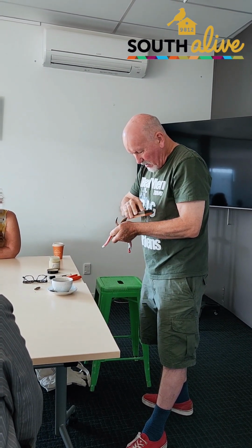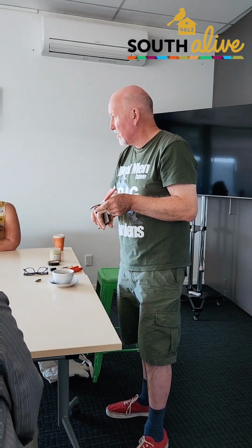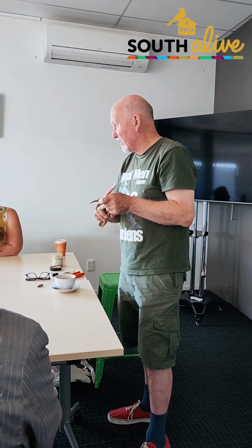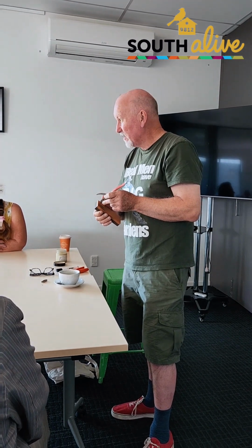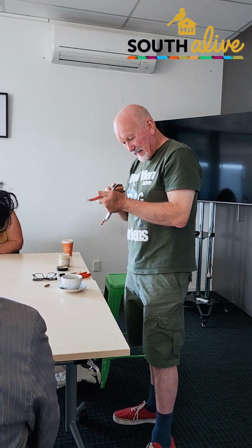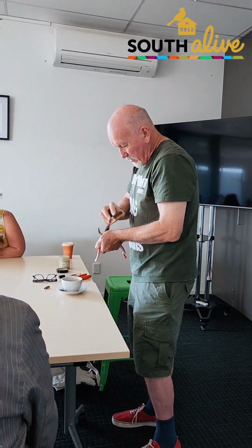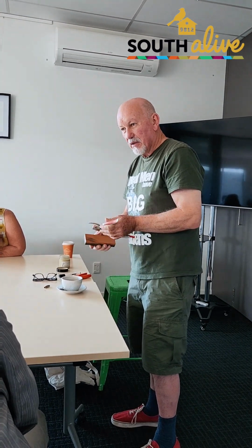Now, I'll tell you, sometimes when you do that, it creates what we call a feather on the back side. So just hold it flat and go like that, and that takes that off the back side. And suddenly it becomes very sharp. When you're pushing away from you, some of the material you're taking just burrs across to the inside, and you just go like that, and then next minute, sharp. All good?